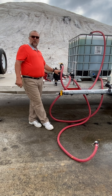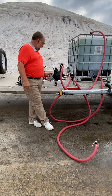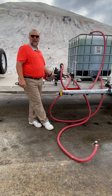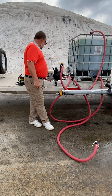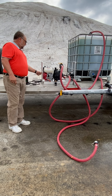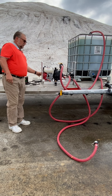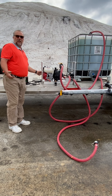Make sure your operators don't run this pump dry — if you run the pump dry, you ruin the seal inside of it, so they have to be very careful of that. Finish on the cleanup: make sure you wash down the flywheel and stator area real well.